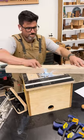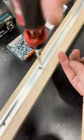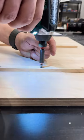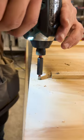Let's add a chamfer to the fence so the dust doesn't collect, and put in our T-track. Now we're going to go ahead and screw in the runners, but you want to make sure they don't go through to the base. Then we're going to chamfer those corners so it slides in easier, and wax it so it moves nice and smoothly.